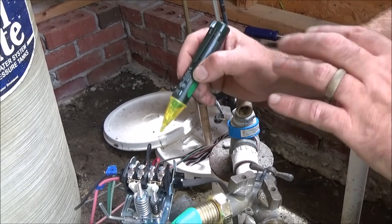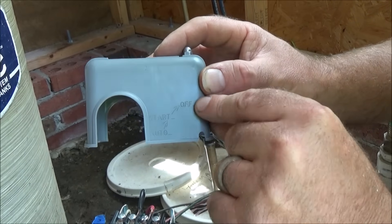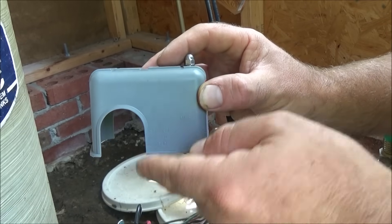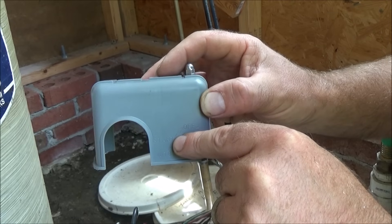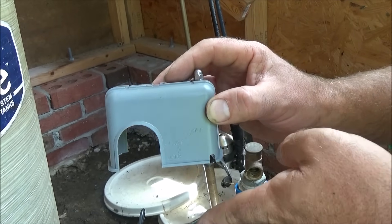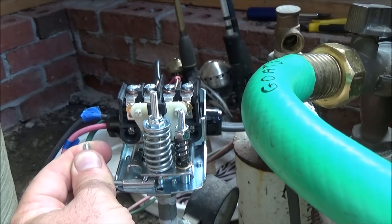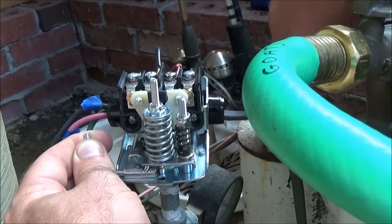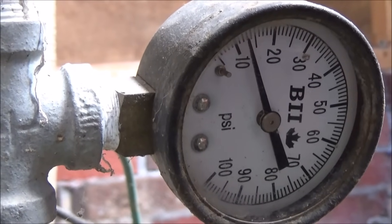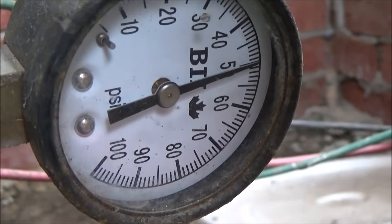I've got this switch in the off position. When the lever is in the upright position, that's off. Then there's start, and then there's auto — this will be set to automatic all the time. However, to get water into it the first time, I have to manually put it in the start position until it fills up to about 50 pounds of pressure, then it'll kick down into the auto position. If there's ever another problem with this pump, like if the points burn out again, I can flip it to start as a manual override. The pressure is going up: 10, 20, taking it to 50. It turned off at 50, so now I'm going to see if it works through the garden hose before connecting it to the house.